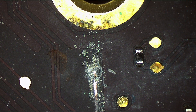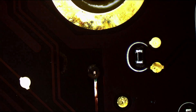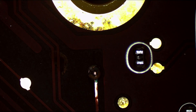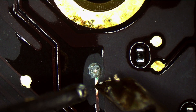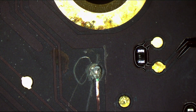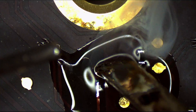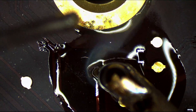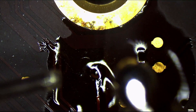Okay, now once it's cleaned off — once I've scraped away everything there — I'm going to clean it with some alcohol. Someone had to have cleaned this before I got to it because this would usually have corrosion on it and it did not. We clean it off with some alcohol, then get rid of the alcohol with some heat. Add flux because it's going to assist me in running and putting some solder there — solder, for our Australian listeners.